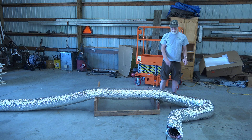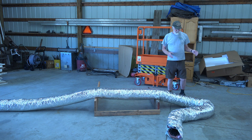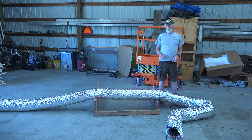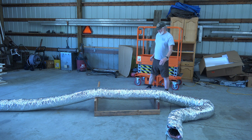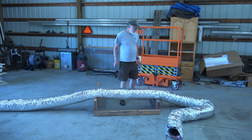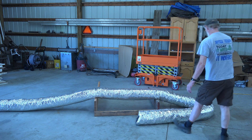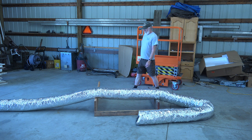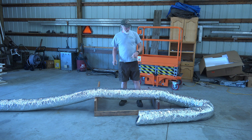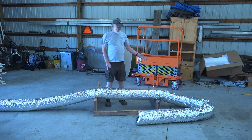Here's one of the things I see quite a bit: we've got a trunk line that fits in there and it's going to go to the diffuser out there. You should not — at least in my opinion — turn this stuff with flex duct. I think you should turn it with hard pipe elbows. I know it's done, I know it supposedly works, but that's an air restriction big time. Even if you put this at the end of the trunk line, you've still got a 180-degree turn in duct that is not smooth inside.